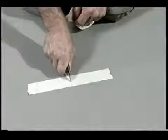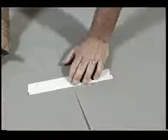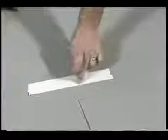To accomplish this, we'll use 2-inch wide masking tape and stretch it across the seams, leaving about 2 to 3 inches on both sides. Next, we'll cut the tape along the seam. When we get to the wall hanging stage, we'll use these to align each sheet as it was originally trace cut.